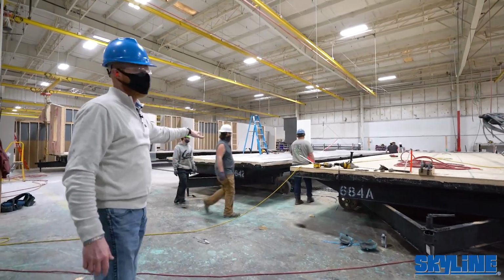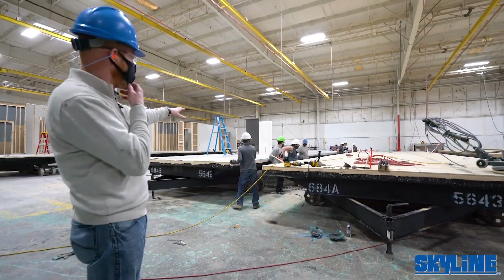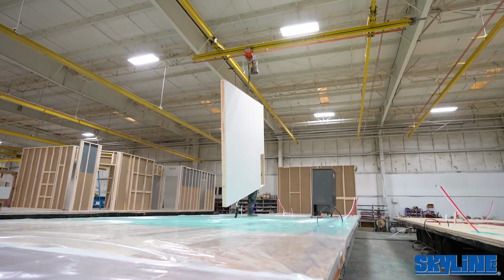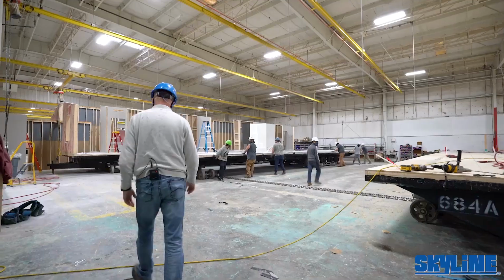After the floor goods are laid down, you'll start to see some of the showers and tub combos being put in place after they've put 2 layers of visqueen to protect the floor goods. Even the OSB, even if it didn't have rolled goods on it, they still put the plastic on there to keep the decking clean.